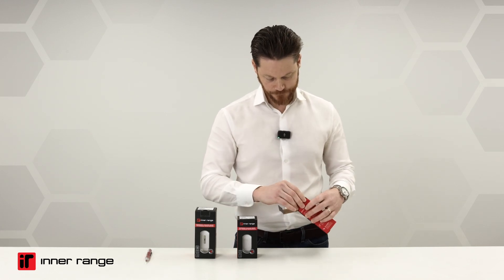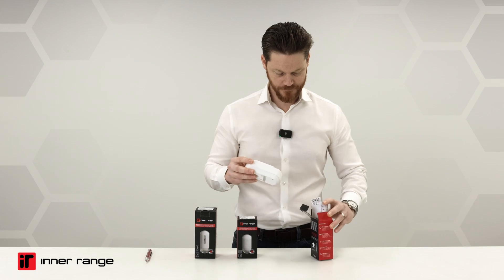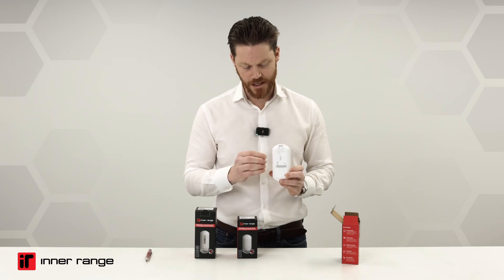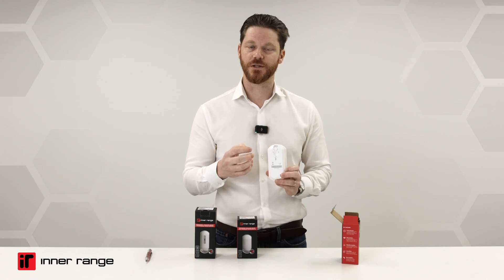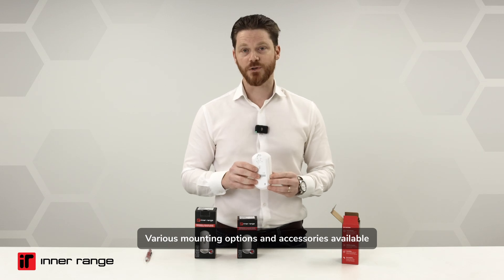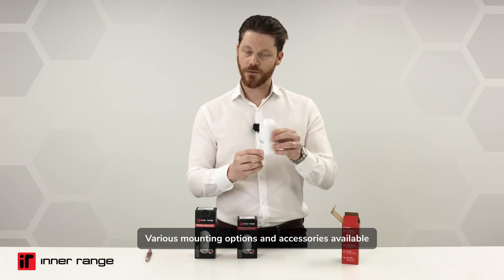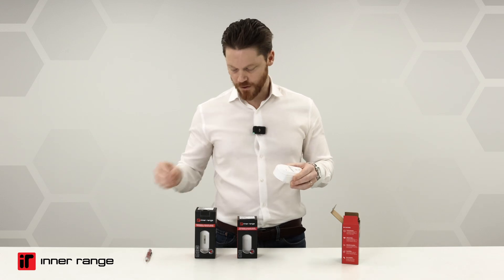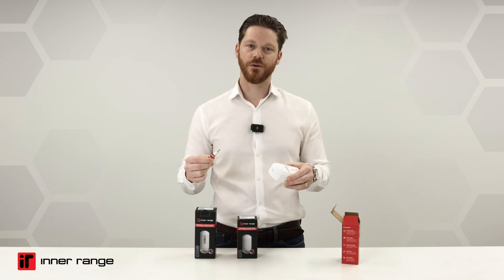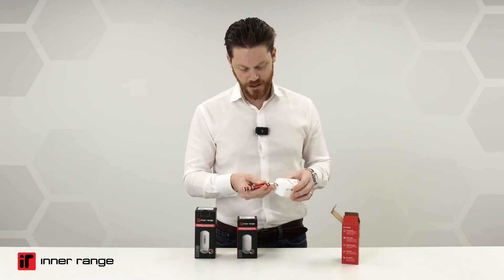Let's go ahead and open up this detector. It's nicely packed and pretty straightforward from the outside. On the back, you can see this little round nodule — that's for installations where you need to mount the detector on the ceiling, and there's a range of accessories and bracket options for that. The vast majority of installations will simply be on the wall, typically in the corner, and you can see the nice 45-degree angle to allow for corner installations. Down the bottom, there's a convenient 180-degree twist with a captive screw — no more dropping screws on construction sites. Simply twist it, it's captive, then pop it open.